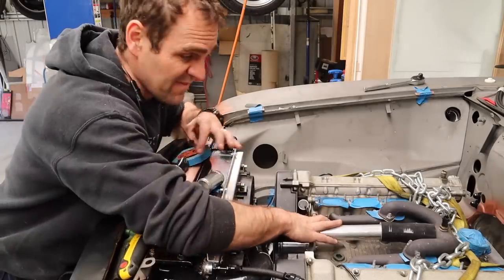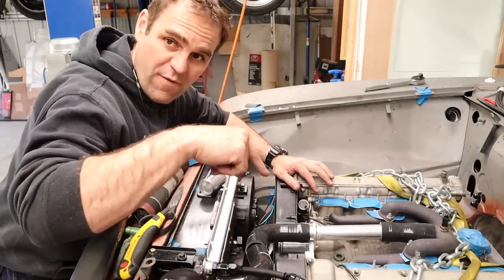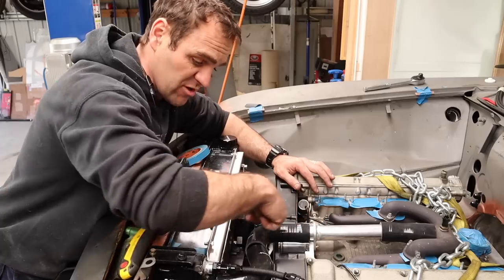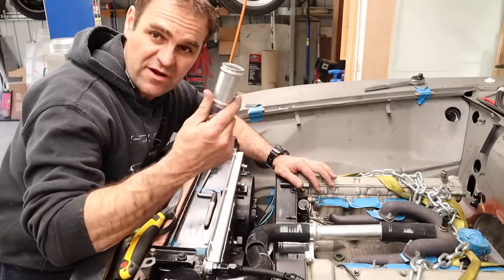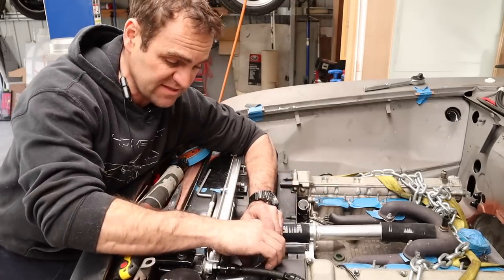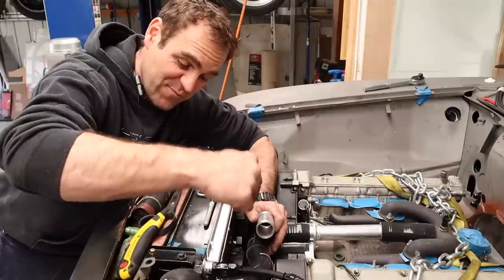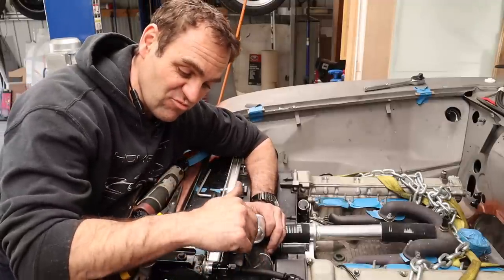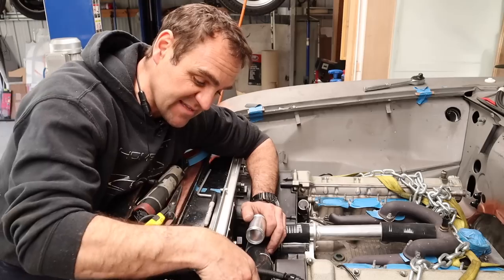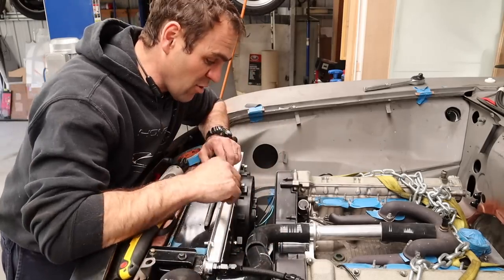All right, I'm really happy with that. That's all in there now. So I've got my tube going from the top of the radiator across. I've got a couple of 90 degree Raceworks fittings in there. I've got a little joiner that I just made up to join those two pieces together. So that will work nicely. I do need to trim out the fan shroud on the other side now because the silicone hose actually butts up against it just on the edge of it over here. So more trimming on that to do.